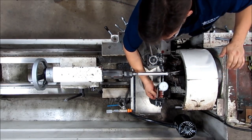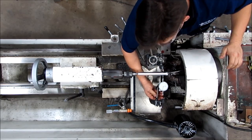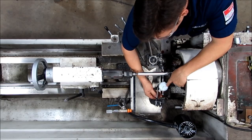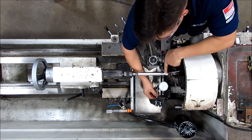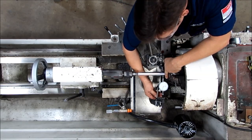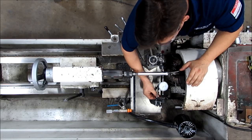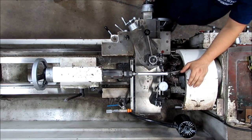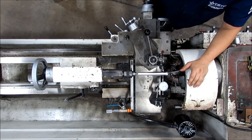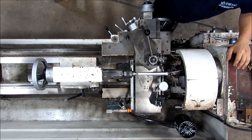So when I do that, if I need to, I will use my fine adjustment to bring it up or down. I'm going to check for the high point by bringing it up and down. The high point is the point at which it is furthest back. It looks like I'm at about plus four as my real high point. Then I'll just re-zero. That's perfect — I'm just a tiny little bit off, so I'll keep that in mind.